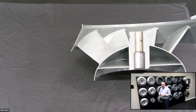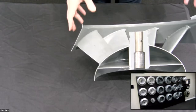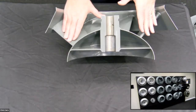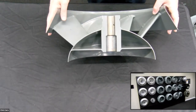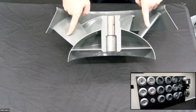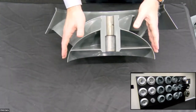If you're moving a lot of air in an axial direction, you want a propeller axial fan. This wheel, okay, you have more pressure, you are going to be more efficient moving air in an inline application because of the way the wheel is designed. So same concept, we have a wheel shroud here, we have blades, we have a hub, but the key is this dome here that allows the air to curve.